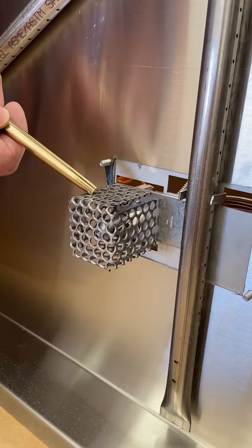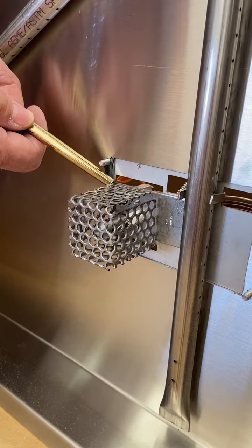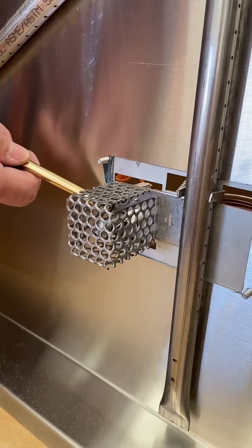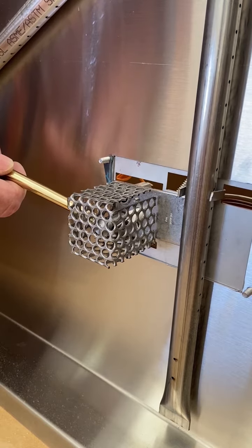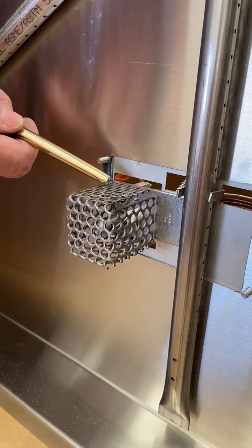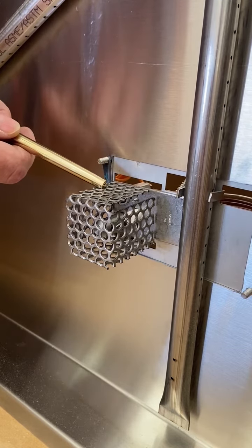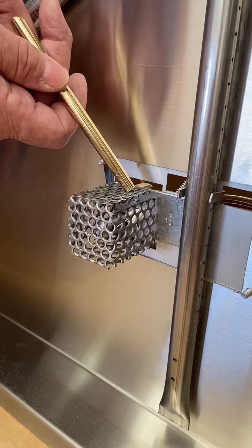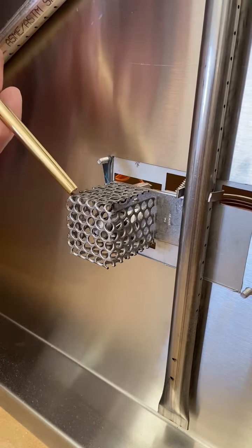We need to keep our little thermocouple sensor from overheating. Inside that mesh is about a half inch diameter stainless steel rod that sticks up — that's the little pilot flame that shoots out of it. There's a nickel-plated sensor about the diameter of the top of a pen, about two inches long, that senses the flame. And then there's a white ceramic spark plug that lights the pilot itself.